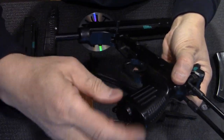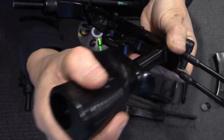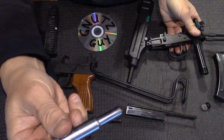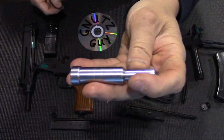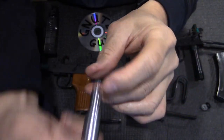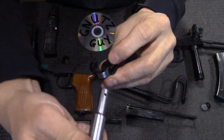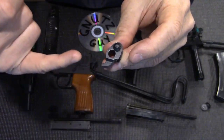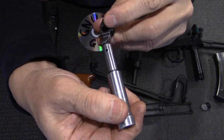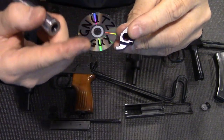The hammer is spring-loaded at the base of the grip. When you remove the base, the grip also comes out. Inside the grip tube is a hammer. The real hammer looks similar to this, but there's another piece that slides along this hammer. When it comes up, that piece acts as additional hammering of the pivoting piece. So when the bolt strikes this part, it hooks onto it, this piece pivots and pushes the hammer down the grip, then comes back up, releases the pivot arm, releases the bolt, and the bolt goes forward.